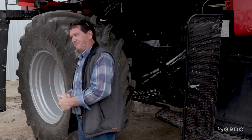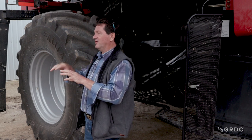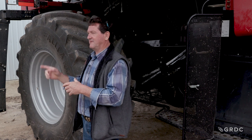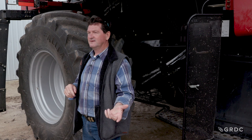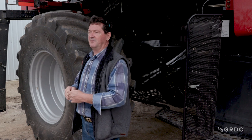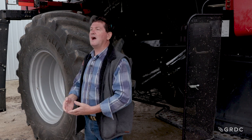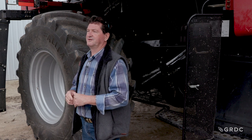What's the byproduct of all of this? If you can keep your straw intact, your mog loading on your sieve goes down. When your mog loading goes down, your sieve works better, easier, cleaner — it separates more easily. It's much easier to set your header up: punch in your numbers and it'll stay that way all day. The only thing you might change is closing the concave a little early morning and late evening as losses increase.